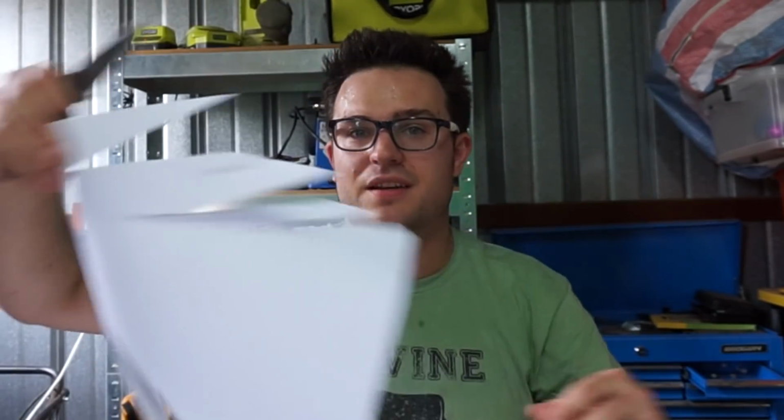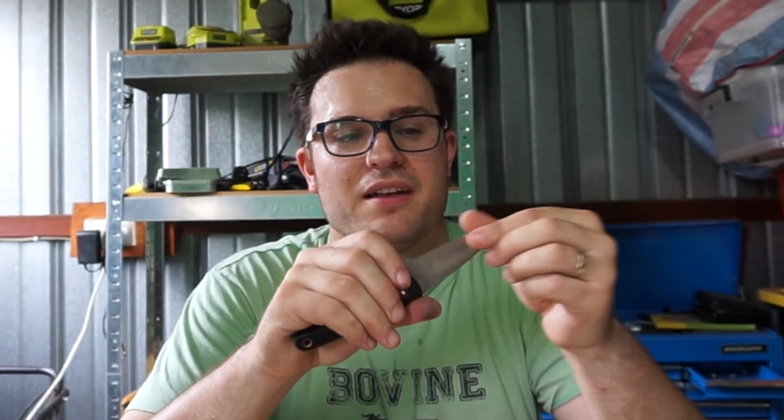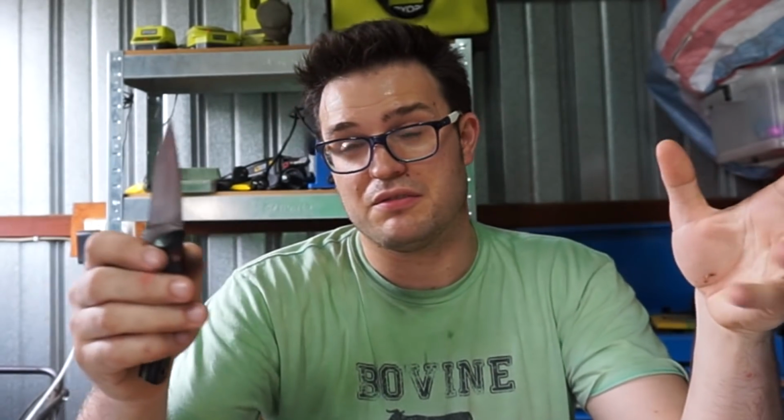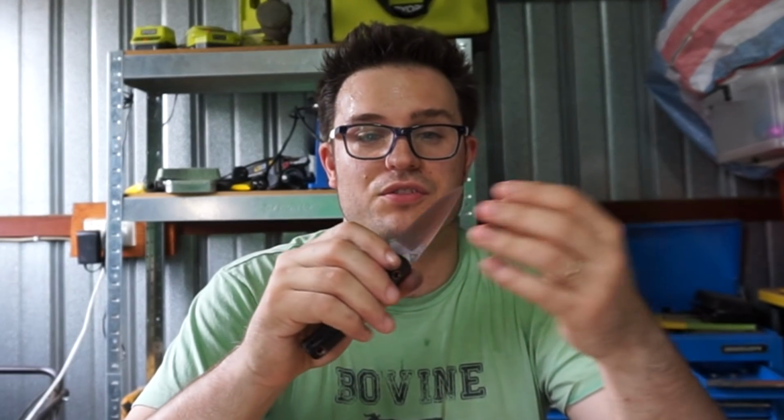Okay, so somewhere between 1180 and 1200, it lost its ability to do these sorts of cuts and began doing this sort of thing where it snags and then tears. So that in my testing is where it no longer has that absolute apex sharpness. So not quite catching Jethro's 1300 result, but for my own sharpening work, 1180 to 1200, I'm pretty damn happy with that. That's a good result.